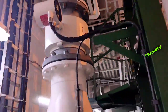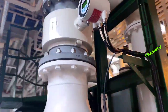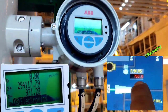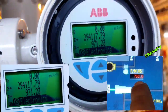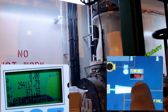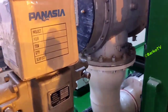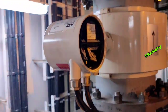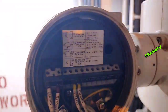They already opened this flow meter to check the sensor. The reading in the flow meter display is zero, but the output going to the PLC is 750. We think that the output of this flow meter is the problem, because the display shows zero while the output is 750. I decided to check the signal.